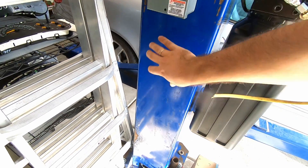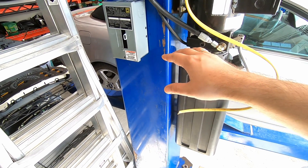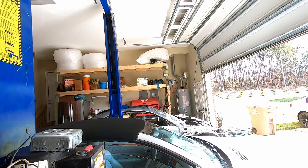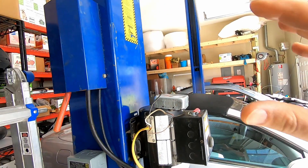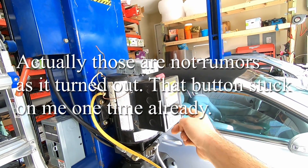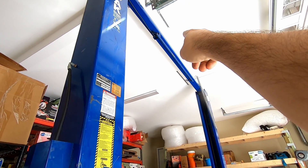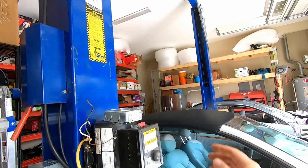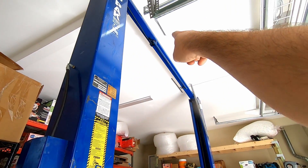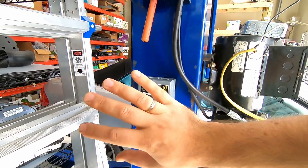It's gonna be a combination of 120 and 240 outlets. This breaker box is gonna work only for the 120-volt outlet, because the main breaker for the lift and the 240-volt outlet is gonna be inside the box on the wall. Later on, I'm most likely gonna install one more emergency shutoff switch for the lift, because I heard rumors that the lift may run away if this button gets stuck. There is one more cutoff switch on the top once the car hits the bar, but you don't want to take a chance — if you know the button is stuck, you'd like to cut off the power right away rather than waiting until the car hits the limit switch on top.